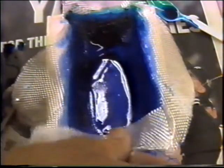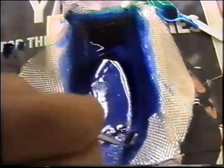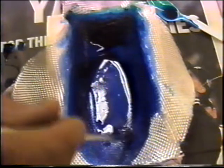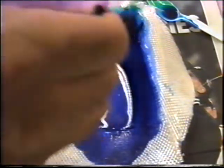Okay, now, I also wanted to get a couple reinforcing layers back here. Again, this is where the bolt hold down is going to be, so we really have some places 2 layers of 4 ounce, some pieces 1 layer of 4 ounce, but now I also take, and these are carbon fiber strips, because in the front here, this is where it's going to take a lot of stress. We're going to relieve this for the needle valve hole and everything. This is going to take a lot of stress up here.